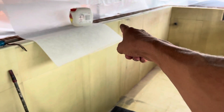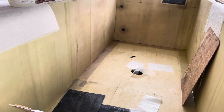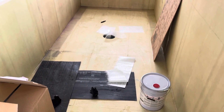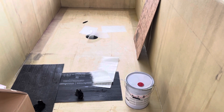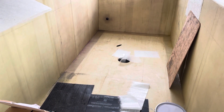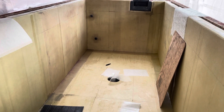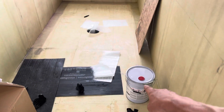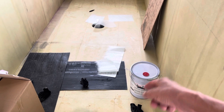I was going to do one hit all the way around, join the floor up and capture the bottom drain - absolutely no chance. Because I've learned over the last two jobs that this resin, the way it has been modified - and I suspect because it's changed from its normal pink color to a more purpley color - there's more cobalt in it. Cobalt accelerator is something you put in when you're working in cold weather; you put more cobalt in it in its neat form than is already in there.